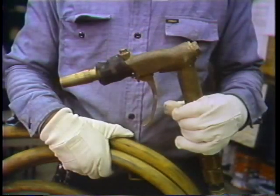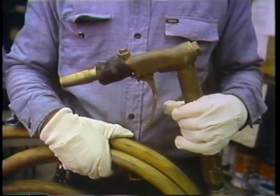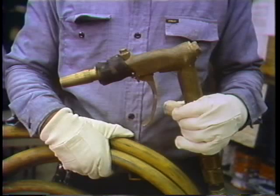Shooting the tubes involves the use of a high-pressure water gun. Depending on the kind and amount of debris blocking the tubes, the mechanic may do the job one of four ways. If there's only mud or silt accumulated inside, he may just use a stream of water from the gun. Sometimes the gun may have a fitting that allows pumping in compressed air to knock stubborn accumulation off the tube walls. A second method is rubber squeegees that just fit inside the tubes, forced through by the stream of water. They remove slime or soft deposits better than water or water and air alone.